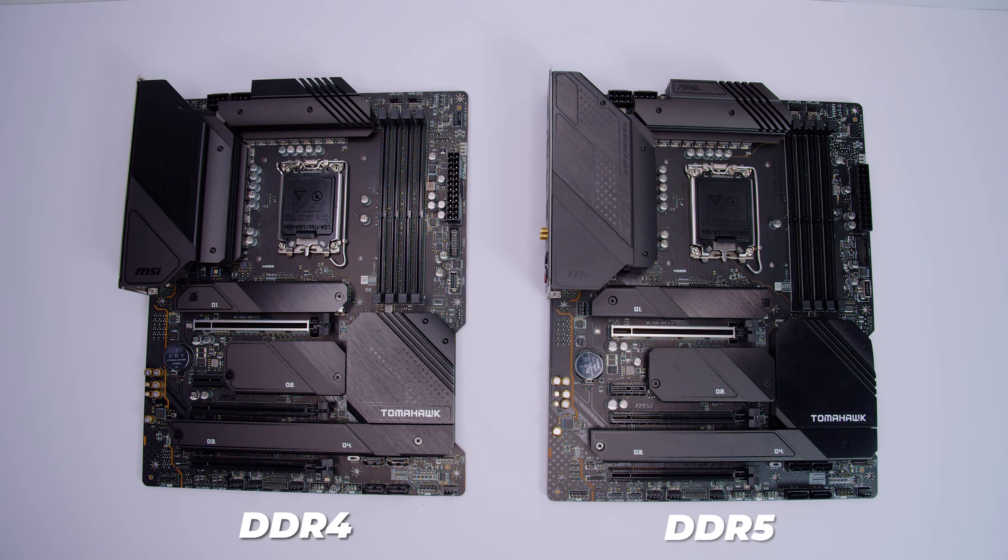Here's a quick comparison between the DDR4 version and the DDR5 version side by side. The boards differ in that the DDR4 version has an extra surface-mounted capacitor next to the CPU socket that the DDR5 version doesn't have. There are also additional capacitors next to the 24-pin power connector on the DDR4 version that aren't populated on the DDR5 version, and some capacitor offsets are slightly different — due to the memory traces and power delivery voltages being considerably different between the two versions. Other than the memory and voltage-related differences, the boards are feature-wise relatively exactly the same.